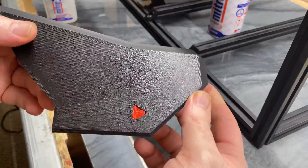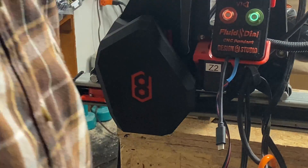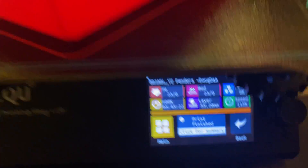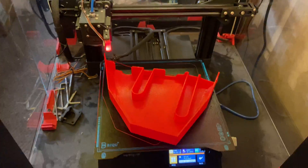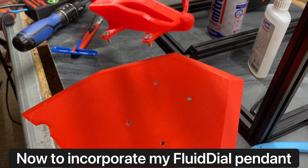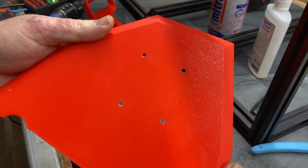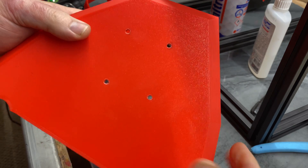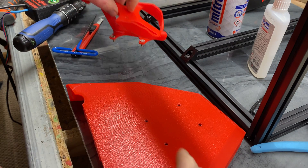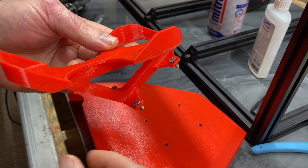Here was my second test fit install of the new third fender that accommodates the Y-extend plate, which is part of my hidden belts mod. A little gratuitous 3D printing footage of the top fender. I used my cradle as a marking template to mark the holes for mounting my cradle on the new top fender. I used a 5/32nd drill bit to pre-drill these, and I've used some tapered head M4 by 10 screws to attach this along with M4 nuts on the other side.